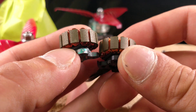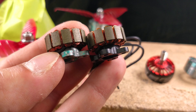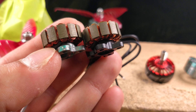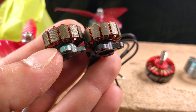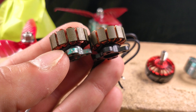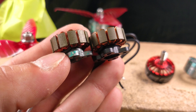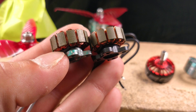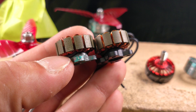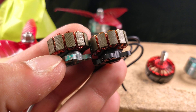The advantage to having really thin laminations is that the motor tends to be a little bit more efficient and a little bit more powerful. But I've had three motor manufacturers independently — 3B, the GetFPV company, Lumineer, and another company I can't recall — all tell me that going from 0.2 to 0.15 to 0.1 millimeter laminations is really a tiny difference, like single percentage points. So it just adds a lot of cost. This is one area where budget motors save by sticking to 0.15 or 0.2 millimeter laminations. This Racer Star motor looks like it has either 0.12, 0.15, or 0.2 millimeter laminations, which I don't really see as a problem.